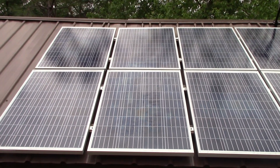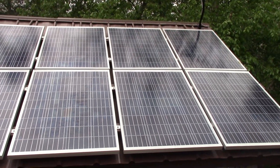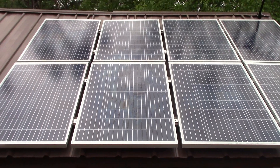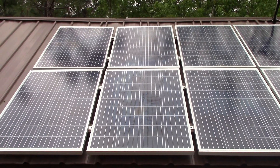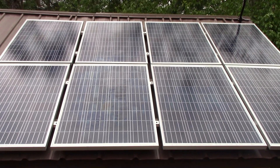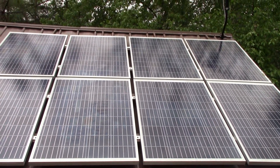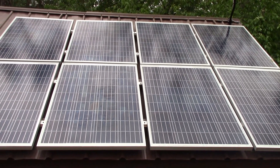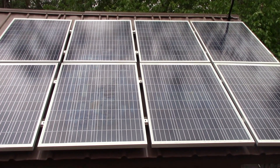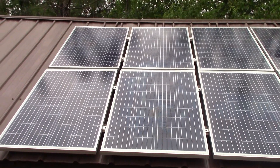It's still in progress. The panels are up and I've had this thing powered up to the point where I was pulling 111 amps. It's actually set up for over 500 amps, and I use all 300-amp wire because my full load — I've oversized this. I've run my air conditioner already, run everything, and I think the max I went up to is about 77 amps DC.